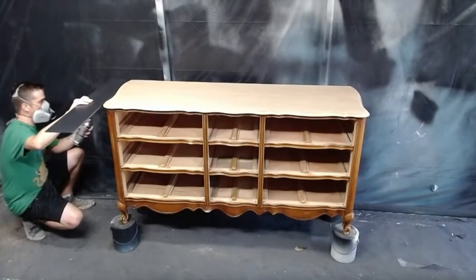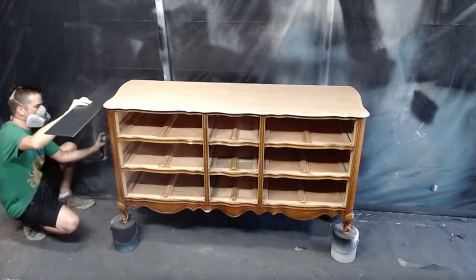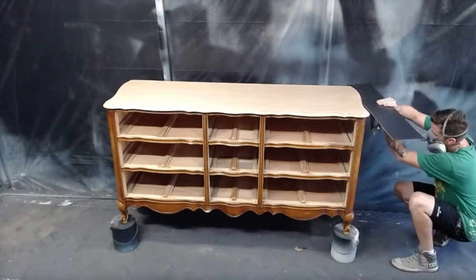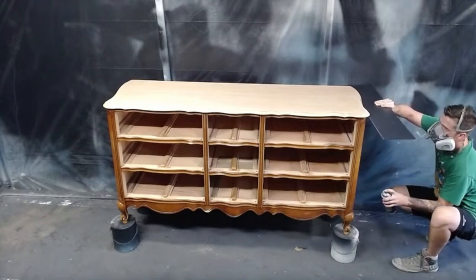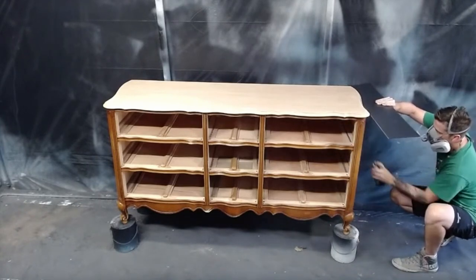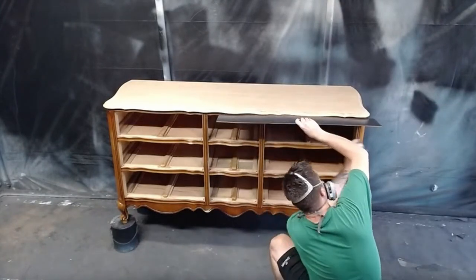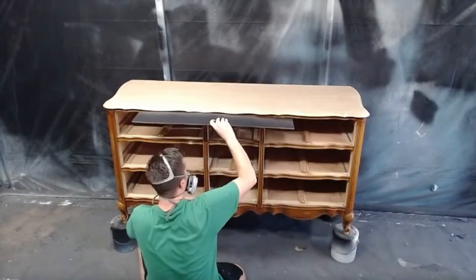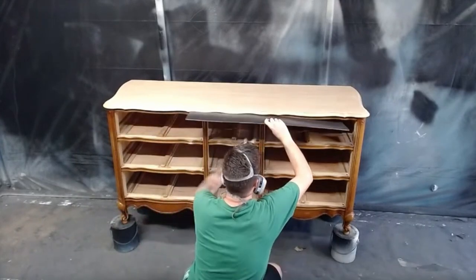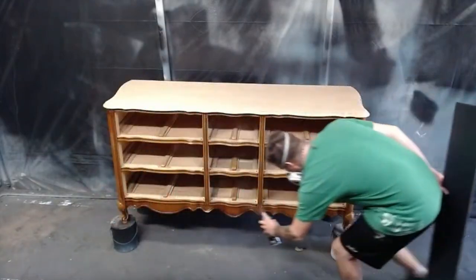On this piece, I decided to seal it with some clear lacquer just to make sure I didn't have any bleeds coming through the paint later on. Bleeds would happen because I sanded the original finish, and the wood stain and the wood I exposed would interact with the water-based paint, causing stains to come up in the paint whenever it dries. You can use primer, shellac, lacquer, or spray paint — anything that creates a barrier between the oil-based wood and the water-based paint will have the same effect. When using this aerosol lacquer, I apply two quick coats waiting about 15 to 30 minutes in between each coat, and then it's ready to be painted over.